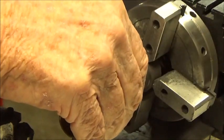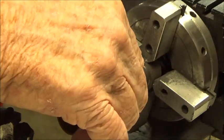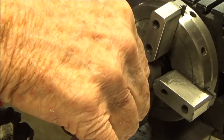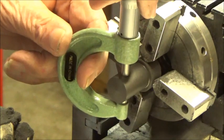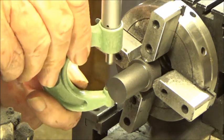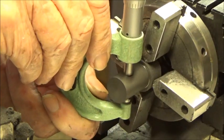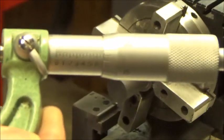At this point we've whittled it down enough that we're going to start trying to fit a piece of tubing that's the same size as the piston chamber. Obviously it's a little bit too large right now. So we've got to whittle this down by about half a thousandth per pass until we get it exactly right. If the piston fits too tight in the chamber it won't work. If it fits too loose in the chamber, it won't work. So it has to be pretty darn close.